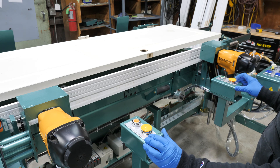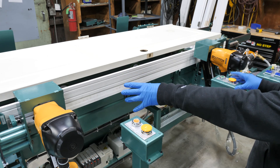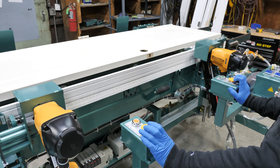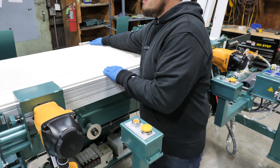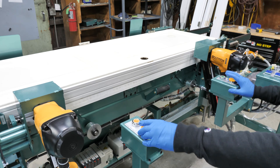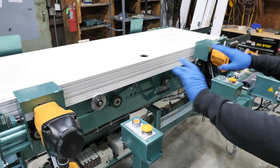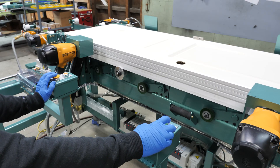Now that we have our head jam and our strike jam in place, we are ready to drop the door in place. We will use the hands clear buttons to operate the machine. In the first stage, the heads move in to hold the jam clamp. The PLC reads which side has a header in place, and the appropriate guns are raised. The next step, we will fire here. The door drops in place. We want to push the door in, and we are ready to cycle it forward. The fixed side heads now are holding the jam in place, and we are able to move forward. That stage clamped the door into its final clamp position. It's ready now for staples. To do that, we will use the left hands clear and the right fire guns button.